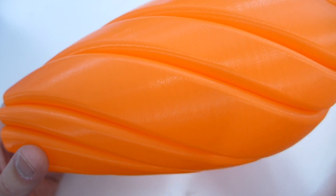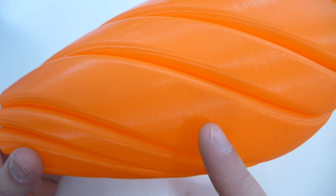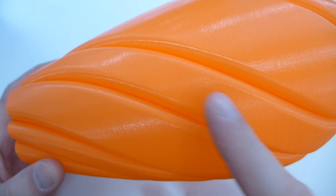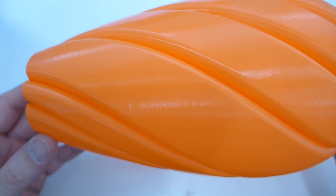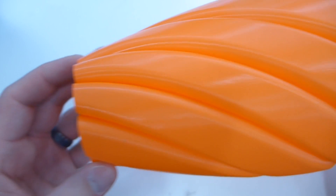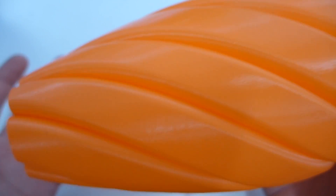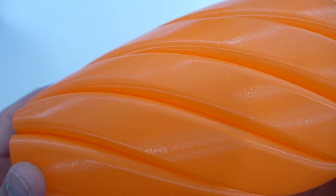I went ahead and threw on the four-diode versions of the TL smoothers onto the printer, reprinted this exact same G-code, exact same filament, just hit print, and boom — it's gone. You can see some of the layer lines, but holy cow, is this smooth. All in vase mode, so it's one continuous string all the way up. It's nice and shiny. It just looks great all the way up to the top. This just turned out great. I didn't redo the benchy in this just because you can see the difference right then and there very easily.